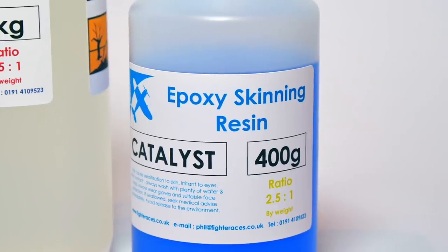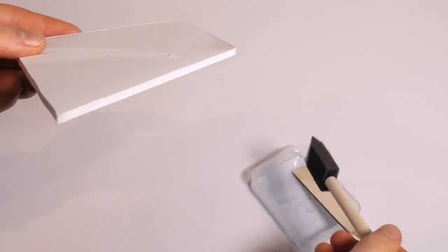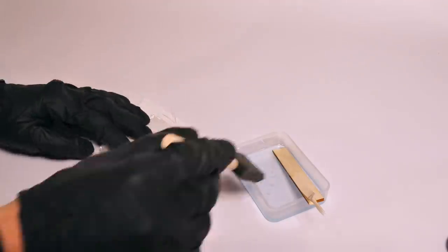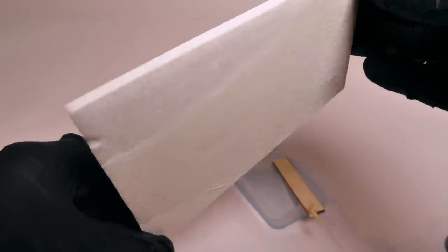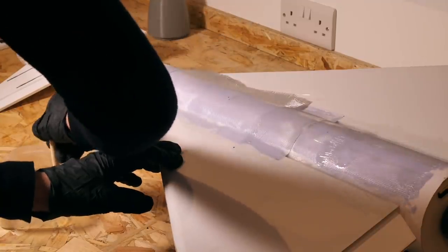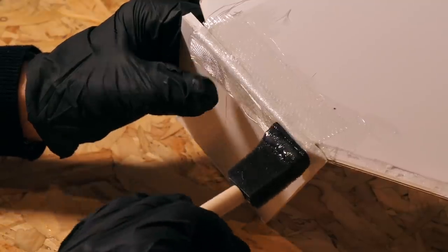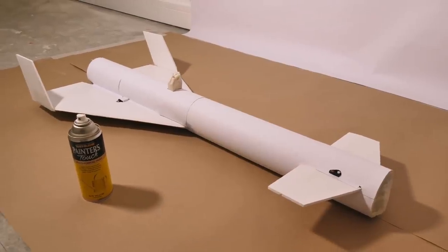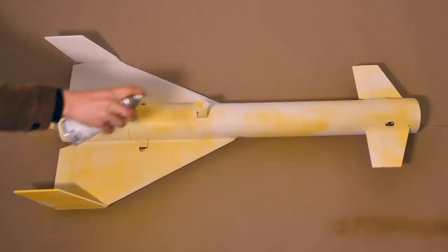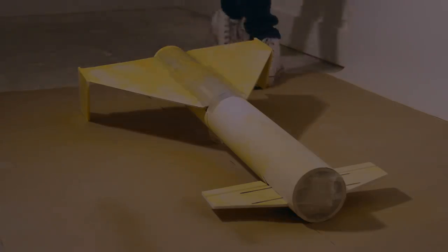I'll leave a list of items I used on this build in the description. I mixed the resin and catalyst before testing some foam offcuts to make certain I wasn't about to melt all of my hard work. I used some 100 gram glass cloth and tried it first on a test sample. Nothing dramatic occurred, so I began layering up the underside of the fuselage. If you've never done this before like I hadn't, I can describe the experience as being much easier than imagined and almost like a grown-up paper mache. The main part I wanted to strengthen were the winglets - it is very important that these remain attached to the aircraft. The DIY shop had run completely out of orange paint, so I opted for bright yellow instead. I've found it's best to do a few light coats, taking your time and exercising lots of patience. All that remained was to add some stickers, hook up the control surfaces and see how the finished aircraft turned out.